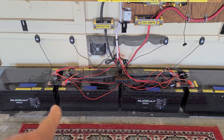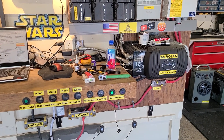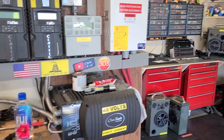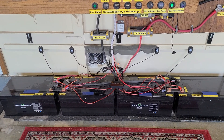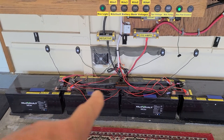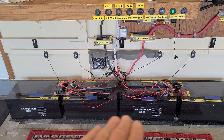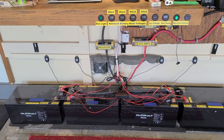I need to have this battery bank working because tonight we're supposed to get thunderstorms, hail, and wind, and I need backup power for the house — running six circuits into the mains. I'm buying grid power right now. I want to do a full discharge like many viewers are suggesting, and hopefully that'll reset the internal BMS on all four batteries — get them down to below 5% or close to zero. You might have to do individual 12-volt battery discharging. The goal is to get them to reset, sort themselves out, and with that balancer bring them all up to 100% state of charge.